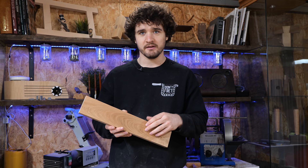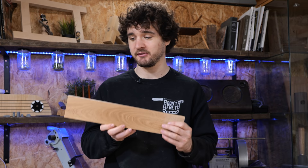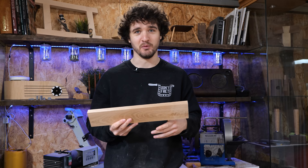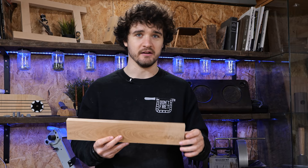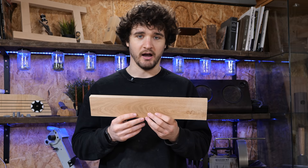Hopefully you can see that by carefully examining the piece, you can quite easily predict where you're going to get tear out. I will stress this is not always the case — sometimes you'll plane a wood in what looks like the direction of the grain but it will begin tearing out. Wood is a natural material; it will play optical illusions on you. If you do experience tear out even though it looks like you're planing with the grain, just try it in the other direction. But 95 to 99% of the time, identifying grain direction using this method will give you a pretty accurate reading.